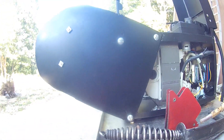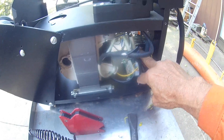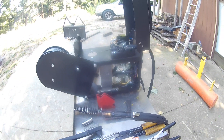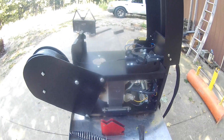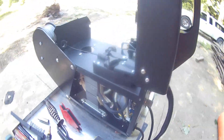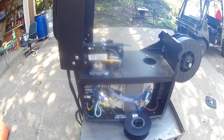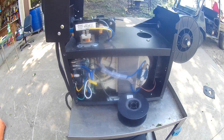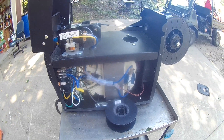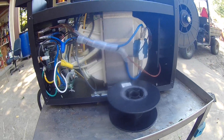I think I've covered just about everything I've done to this thing. The transformer was fifteen bucks, the relay was fifteen dollars, so thirty dollars into modifications — total around a hundred and ten dollars into this unit. The only other thing you could do is convert it to DC, but I've heard that's around another sixty bucks, and if I was going to spend that kind of money I'd just get a bigger welder. But this 110-volt welder, I'm happy with it. I've welded everything I needed to do, and now that I've played around with it I can lay down a real nice bead.